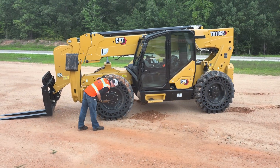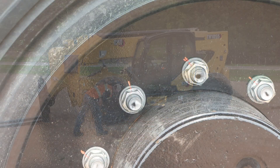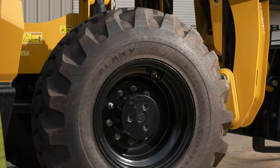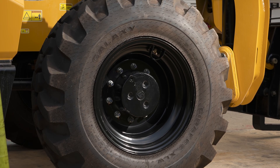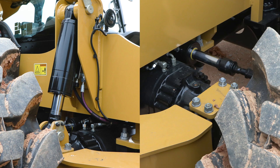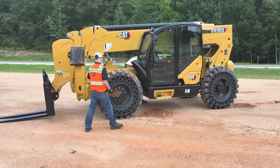The ground level portion of our walk-around will start at the front left solid tire. Make sure to check the lug nuts and tire tread. If the machine is equipped with pneumatic tires, be sure to check the tire pressure and sidewalls for damage. Behind the tires, you'll find the stabilization cylinders, steering cylinders, hoses, axle knuckle bolts, pins, and keys. All tire checks should include a check of these components.